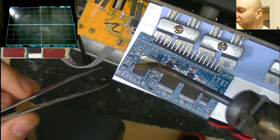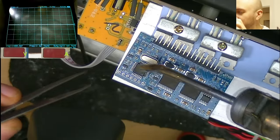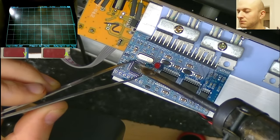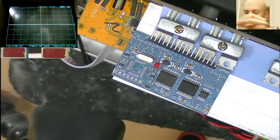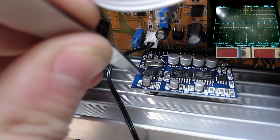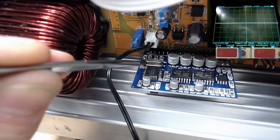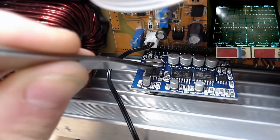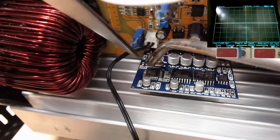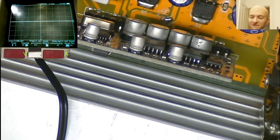First is to get this new one off. I did also get some spare 2113s with this board and a bunch of other parts. 12 megahertz oscillator. There we go. Loads of flux on there, which is good. Just get the position roughly correct. It should pull itself into the right place once the solder's all melted, but I just want to make sure that it's on the correct pins. There we go, it's just pulled itself into place. So, time to see if that's worked then.